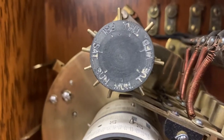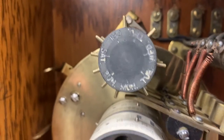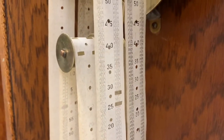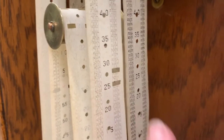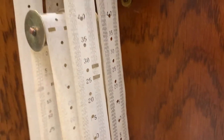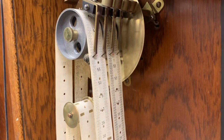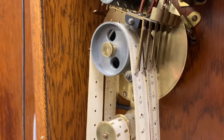This clock knows the difference between days of the week and the difference between AM and PM. It can drive four completely different bell schedules. This particular tape has been punched a couple of times on channel two, and on the back both channels one and two are punched. Another tape here has very few holes. So you could have four completely different schedules powering different parts of your building — different grades in a school or different shift change times — all driven off this punch tape.